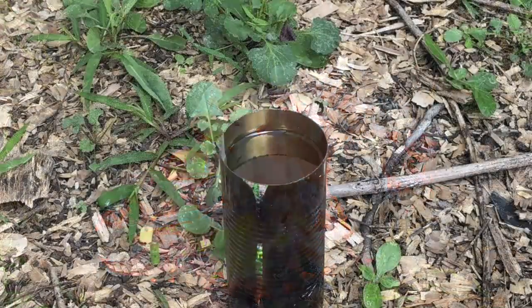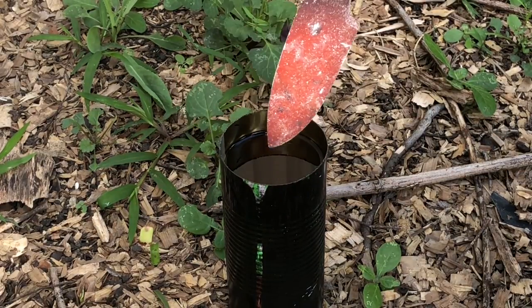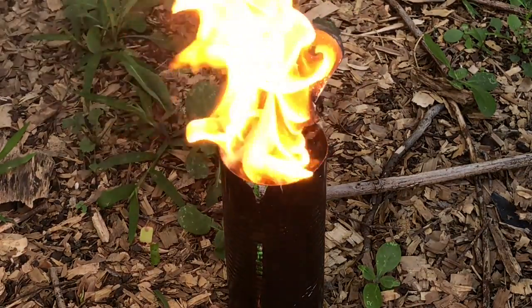After heating the steel evenly to a cherry red color, go ahead and test it with a magnet. If the magnet doesn't stick, it's ready to be quenched. We're quenching in canola oil.